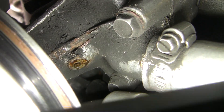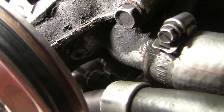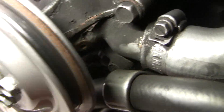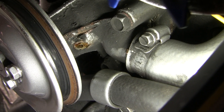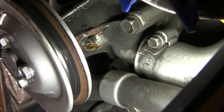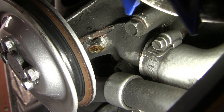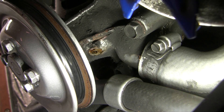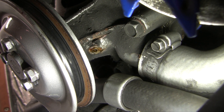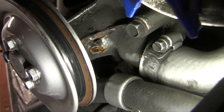Some days it's been quite bad, but it's never been bad enough to justify adding coolant. So why not just leave it? Well, you could leave it — the bearings aren't giving a problem. But eventually what will happen is those bearings will seize. The liquid will damage the bearings and they'll seize. At first it will start giving a loud sound as a warning, but if you ignore the warning, the belt could snap. The bearing could completely seize and the belt could snap. And then you're hooped — you can't use your engine or it will overheat.